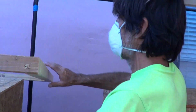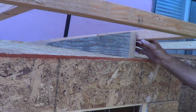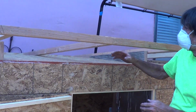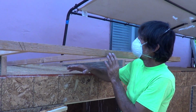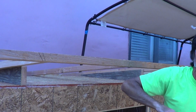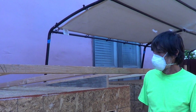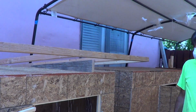I will say that the roof, the whole floating roof thing, I think it goes the other way. I think I may have just measured this wrong and got these on the wrong side. We'll have to figure out the shims for that one. But the roof will have that tarp, stretched on this frame, so it's very lightweight. And this gets bolted down to these tapered pieces. It allows air movement underneath here, so it definitely keeps it cool when the weather's hot. It's a reflective tarp, and you're going to have this airspace in here. So I think that's it.